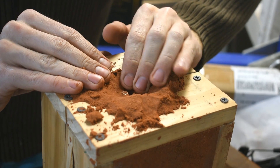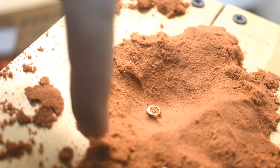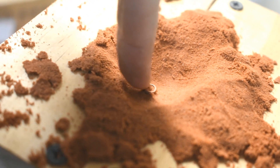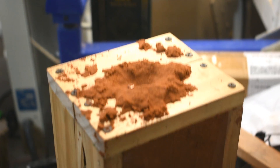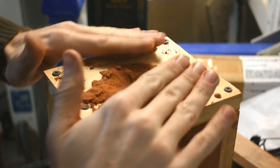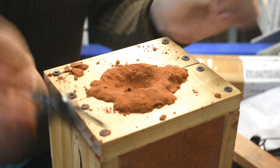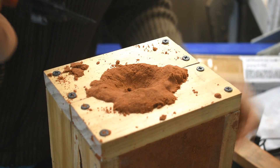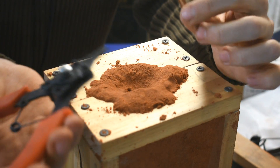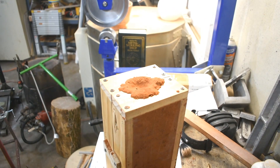For this part, instead of building up a large thing, I'm just going to form my pouring basin right here. I'm going to put this here back in the hole just to stop some sand from falling in there, because at this point the mold is made. I have a basin here with a hole next to it - it's kind of up the ridge around, down deep, and then it overflows down the hole there which is currently plugged. This is really cool - this is like a wire tool; you put the two things in the little C-clip holes, squeeze it, and it pulls it apart so you can get the clips off. Works for copper rod too. Oh, and I should have mentioned this way earlier: I'm going to cast this in aluminum because I have a lot of aluminum left over.